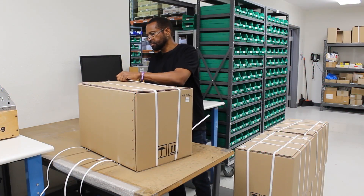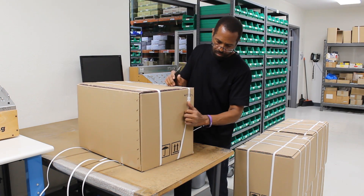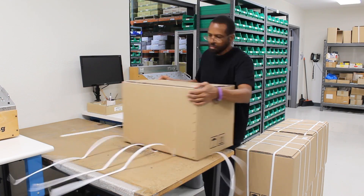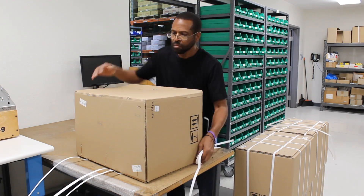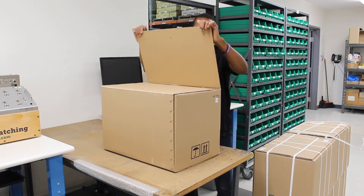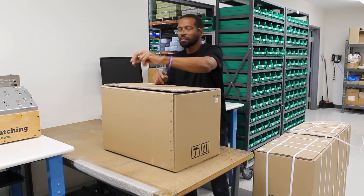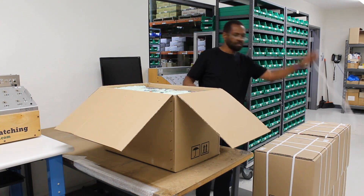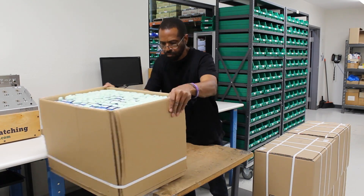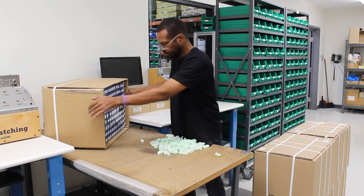While Urban does the unboxing, let's talk about why it's important to match your vacuum tubes. Matched power tubes are a necessity in push-pull tube amp designs. Normal manufacturing variations cause the parameters of each tube to vary somewhat. So if random tubes right off the production line were put into a push-pull amp, the current drawn by each tube, both at idle and under high power drive, could vary from each other as much as 20%.